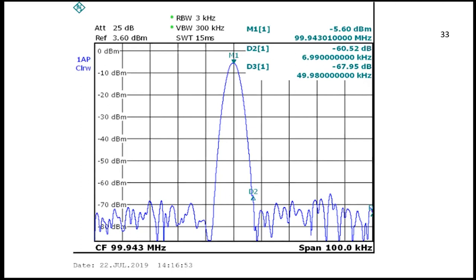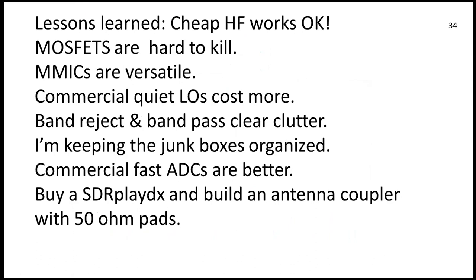These commercial SDRs like SDRplay DX have a noise floor way down there. SDRplay is about $250. The entry SDR — SDR Uno — is around $100 to $110. If I get to look at the architecture, I can see they actually throttle the input with some kind of automatic gain control. The first time I hooked this thing up with big signals, they just swamped me — knocked me off my feet, wiped out the screen — if you don't have some type of interface to attenuate the strong signals.